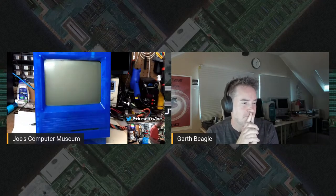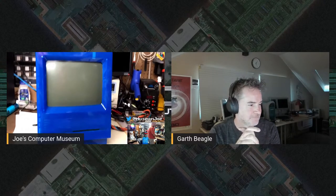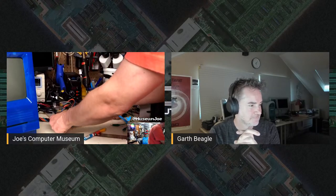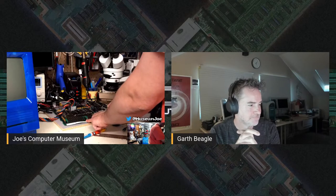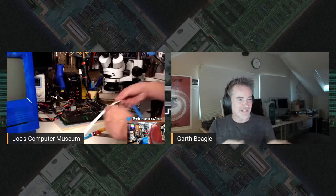That's why for the front on the pumpkin tosh, I did opt to put some in there, but it's on the main board. It's on the actual logic board itself. It goes right along here, and then it taps into 12 volts. But this, I put a higher value resistor on, so it's not as bright. So yeah, I remember you had to hack it into the motherboard down at the bottom, yeah.